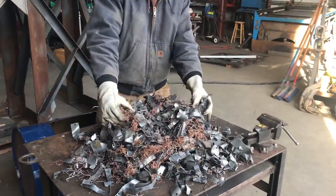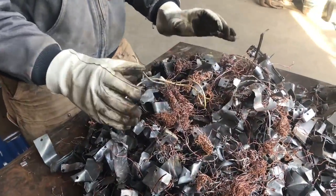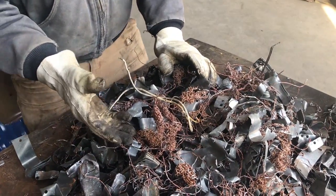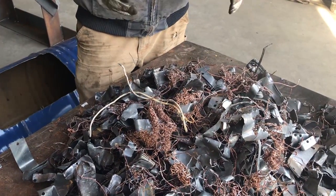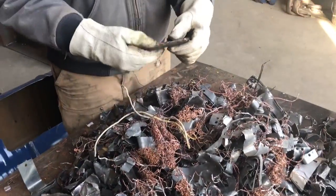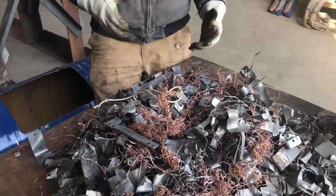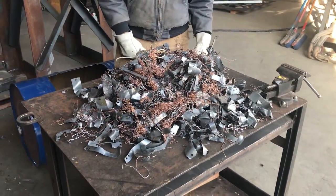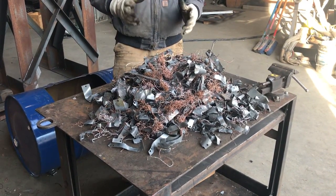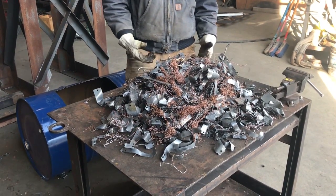So here's our transformer — we ran them through a four inch hole and in this situation it's a pre-shredder, so now they can be run through a smaller hammer mill and across the mag belt. The other option would be to put a smaller screen in this hammer mill so you can run a large single piece but then have it liberate and separate all the copper and steel, then run it under a mag belt. The biggest transformer we ran today was about 20 to 22 pounds, so we can actually run a large piece of scrap metal all at one time, throw in a one inch screen, liberate all the copper and the steel — it's a one-pass system.